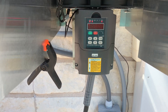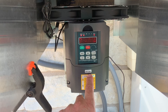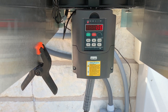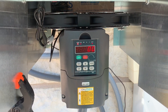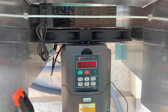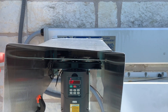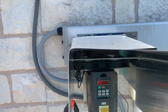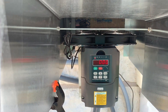The cable has five wires, gauge 12: three of them carry the three-phase output to the motor and two bring 240V input to the inverter. If I were buying the inverter now I would get the 4kW instead of the 3kW, because this 3kW is pretty close to the motor's rating — buy the 4kW for better headroom, it costs about $30 to $40 more. I bought this one for around $150. The fans cost about $25 with the adapter, and the cable cost about $12 to $15.